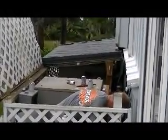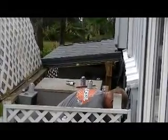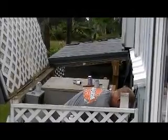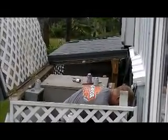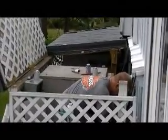These heat pumps were put in in 1990. They're still functioning. They've been covered from the sun a bit, but as you can see, geothermal heat pumps are very reliable and will last 30 years and sometimes more, even though they are outside, unlike air-to-air units that you're familiar with that tend to fail in 5 to 7 years.